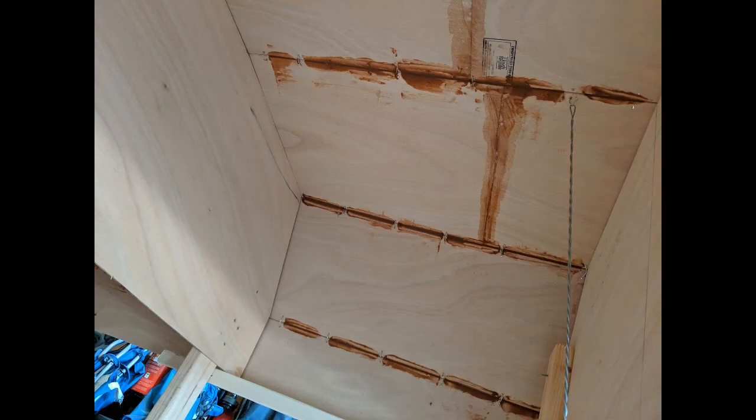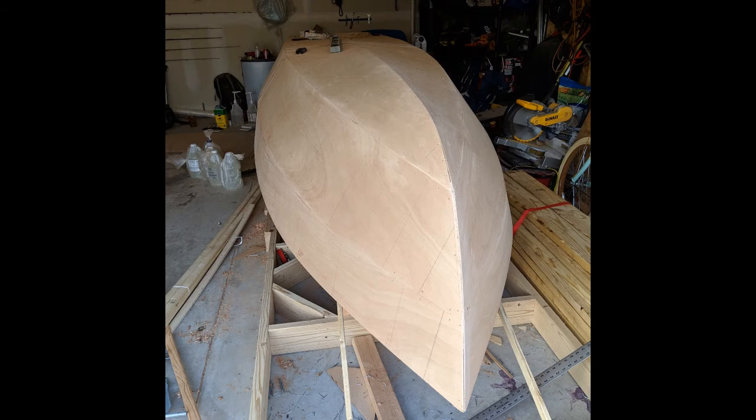Once the general form has been done, go ahead, tie it down in multiple spots, make sure it's not going to shift. And now you're going to climb underneath the boat. Put some wood flour epoxy mix together almost like a paste. You're going to fill that chamfer that we talked about a couple minutes ago in between all the pieces of plywood. And once that's all set, pull all the wire ties. Make sure that it's all set though. Then pull the wire ties. And now hopefully you understand that is why they call it a stitch and glue boat.